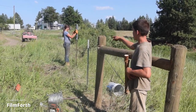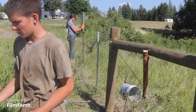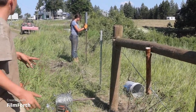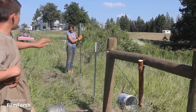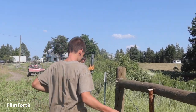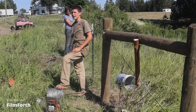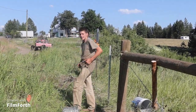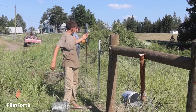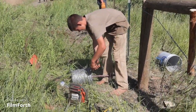Now Caitlin is handling the T-posts and we're going to build a four-strand barbed wire fence — we call it bull wire. We're putting our T-posts 10 feet apart; you could do 8 or 12. We're also going to put fence stays in between the barbed wire strands so the wire doesn't spread open. You can get fence stays online, twist them through the barbed wire, or use barbless wire — we'll cover that in the next video.